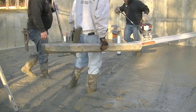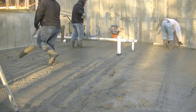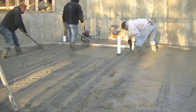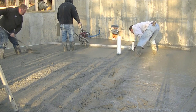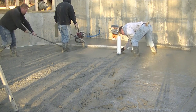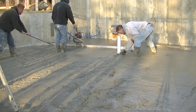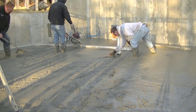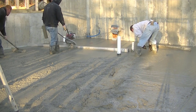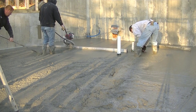The first truck showed up at 6:45. It took us just about 45 minutes to an hour to get this floor poured, so we were done pouring by around 7:45, 8 o'clock. It was then power troweled, sawed, and we were loading the trucks by 2 o'clock in the afternoon. It was only about 40, 41 degrees as the top temperature, and it didn't get much sun either.